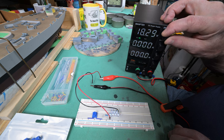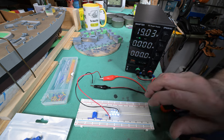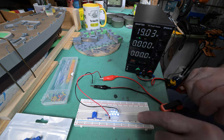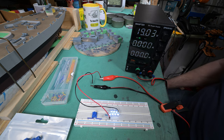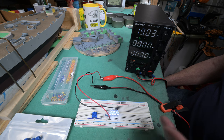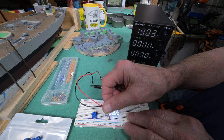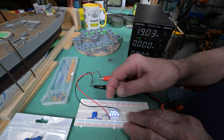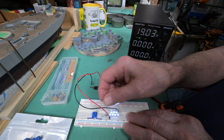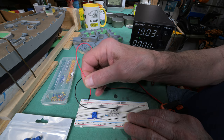We're at 19 volts, and they're quite, quite bright. So when you hook these things up in a series, it's sort of like hooking up one and a half old flashlight batteries in a series. I wasn't sure — I thought this is the way it would be, but I wasn't sure. Now let's go through the resistor, and I notice when I move these wires, I'm getting a lot of flickering going on. It must be this breadboard — it's probably a bit of a bad connection. A person would for sure want to hardwire everything in.